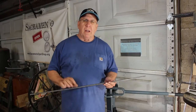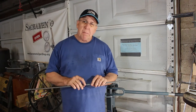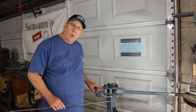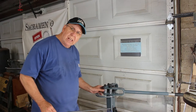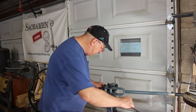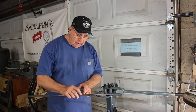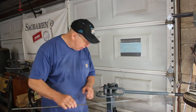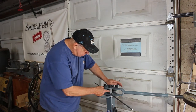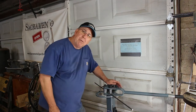I'm ready for a trial run. I've got a 36-inch piece of 3/8-inch hot-rolled rod, which is what I plan to make my hairpin legs out of. It's marked at 18 inches, and I know I want a one-and-a-quarter-inch radius, so I've put the one-and-a-quarter-inch die on the pivot point. This is going to wrap it around. The bend is going to start before the middle, so I need to figure out where to put my center mark. I'm going to try with the center mark on the follower bushing and wrap it around to see what we come up with.